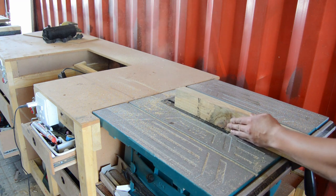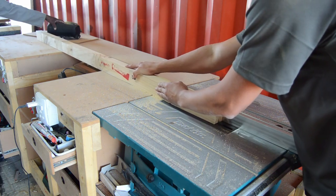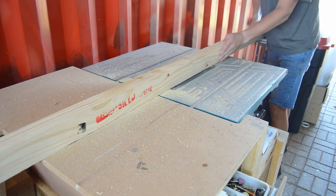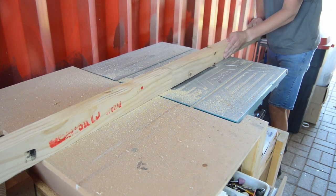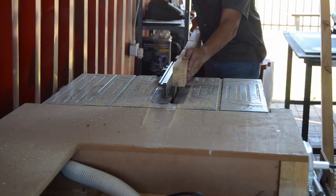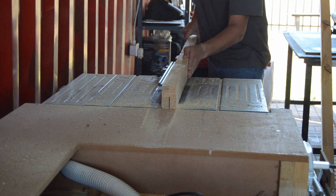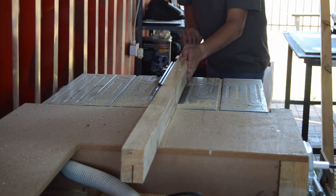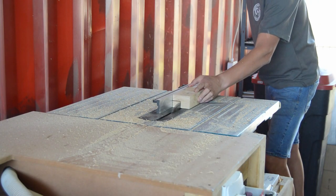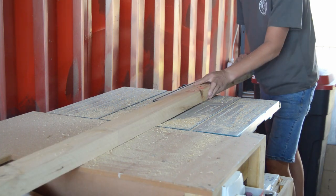Now we're moving on to cutting the beams that will carry the weight of the TV unit — I'm going to use pine beams. The most common question I receive is how to fasten a massive TV unit to the wall. We're going to use a French cleat system, and I'll show exactly how it works in this video. I'm cutting a small square notch out of each pine beam, and you'll need four pine beams total, repeating this process with all of them.